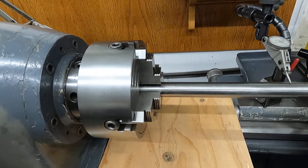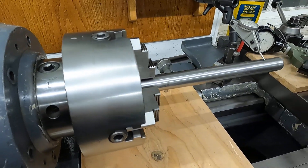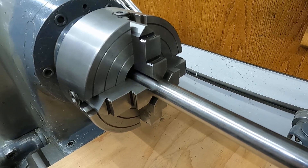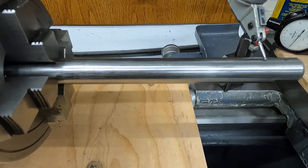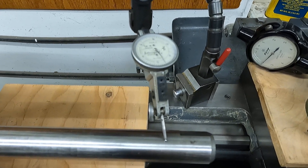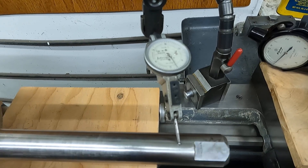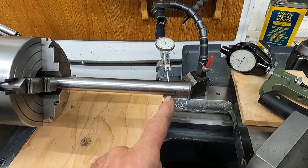Now your chuck — I was talking about the chuck. This is a performance chuck; it's been balanced. It's got some balance wheels in the back, and the jaws have been ground. It's a four-jaw chuck. I'll show you what this will do. You see that dial indicator? It's almost eight inches out there. This bar runs a half-thousandth true that far out.